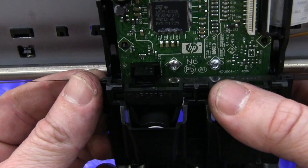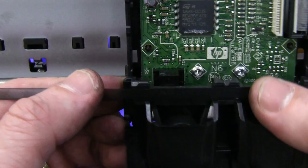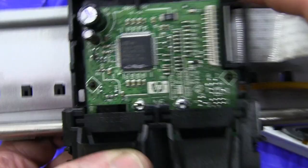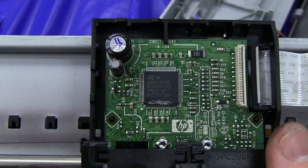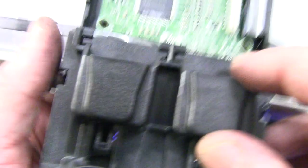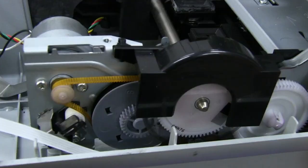There's our photo sensor down in there — just popped it out. It's probably got a tiny little slit in it, capable of very good resolution. But I'm not sure if you could reuse that board. There's an ST part — I'm not going to Google it now. You would have to assume that would be a bit of a lost cause trying to get data out of this thing. You'd take it directly from the photo sensor if you really wanted to. The chip on there maybe hasn't got much to do with the positional sensing at all — it may just feed it back. That's obviously in there for the print heads. You can see the individual wires there going down to the print head mechanism. Looks like it has black and color. Probably can't reuse that board — I'd just get the sensor and then turf it.